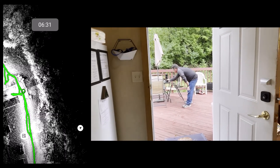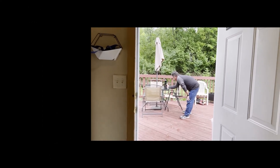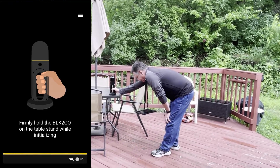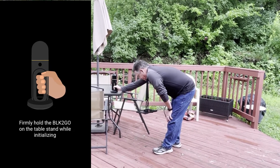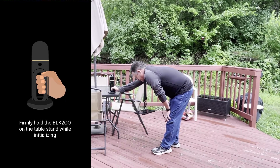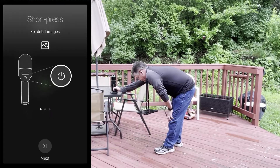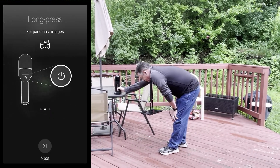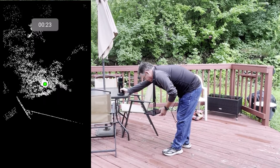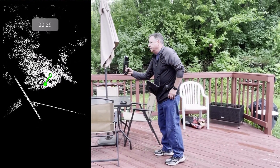I'm going to let it collect data for about another 30 seconds here, then I'll stop the walk and get ready for the next one. Here I will start another walk the same way that I did before — I'll press the button on the scanner, hold it, and allow it to map its starting point. I will then head into the house. Scanning indoors is a little different than outdoors. You'll maintain a slow pace, slightly slower than outside because there's more to map. Please notice that when I go through any doorways, I pause in the threshold to allow it to continue mapping the previous space and also start mapping the new space before I fully enter.